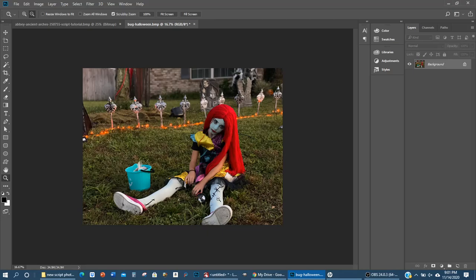If you're getting your blacks looking good but your whites aren't showing up, you need to slow down and probably adjust the power. I adjust my power in micro changes — one-tenth of a percent at a time.